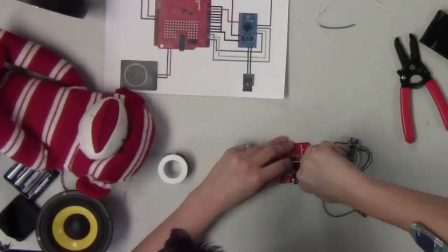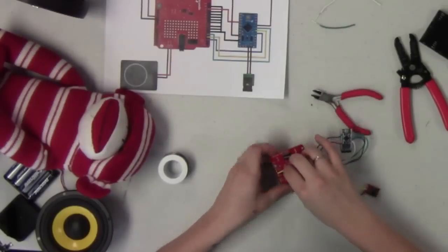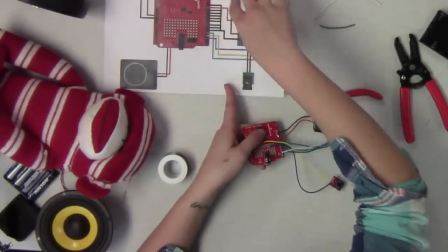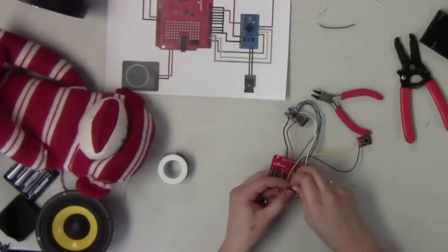Again, I have to do this because otherwise, if we don't fix that resistor now, it can actually end up shorting the board. Without that resistor, you can end up shorting VCC to ground through the button, and then you fry all of your components, and that is no good. But quick, easy fix.